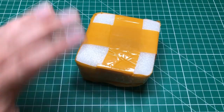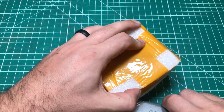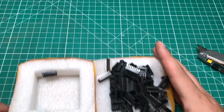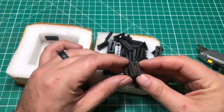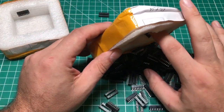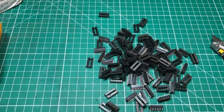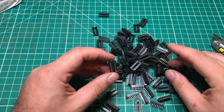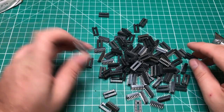Somehow I got four more packages from when I filmed that other part of the video this morning. This one isn't even a box — it's literally just a thing of foam with some tape around it. Oh my gosh. I guess AliExpress has sent worse, but these better all at least be the same size. I ordered a bunch of sockets. I think I ordered a hundred of several different size sockets. I'm just going to assume there's a hundred in here. It's one of those things I've gone back and forth on, but as I buy cheap stuff from AliExpress, I've pretty much learned you have to socket all of it — you're wasting your time if you don't. It's not uncommon for me to test the chips, they test good, and then I use them for a couple of minutes and they just croak out.